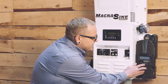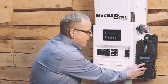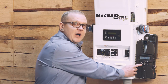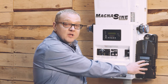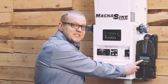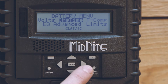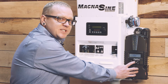Now on the Midnight Classic, the thing to keep in mind is that after you've entered these values, you've got to press the enter button and your controller will flash 'data sent and save to controller.' That's how we know our values are saved. Once you verify they're correct with your battery manufacturer—don't use the ones I used if you're not using CR430s—press the main menu button one time to back out of volts, and use the right arrow to go over one click to charge time. This is where our absorb and equalization times are.